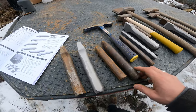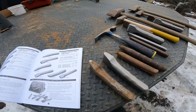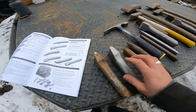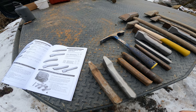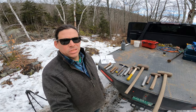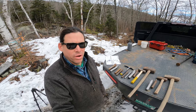The tracers we covered in one of the first splitting videos — you're scoring a line in the granite to establish what I've heard called a cleavage line, a plane for a split to travel along. So those are my hand tools — it's a fairly brief overview and I don't want to get too hung up on the nuances of each one.